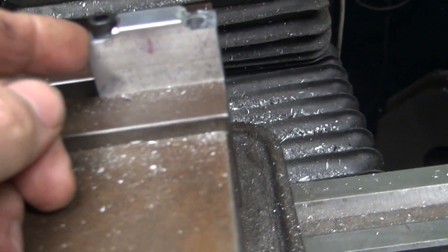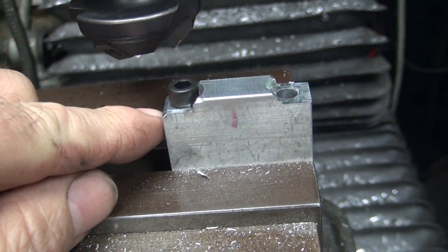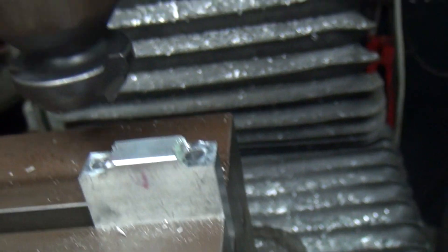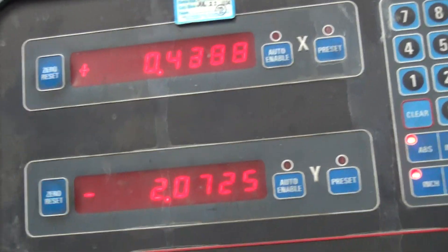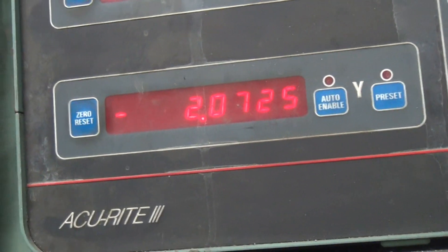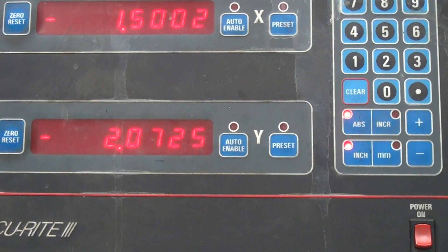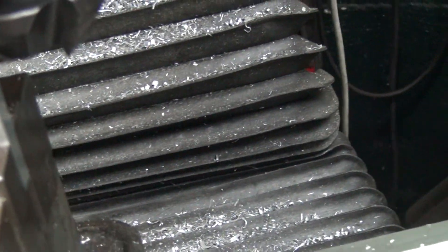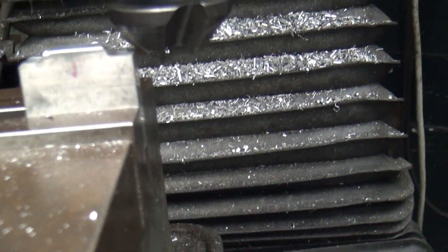Here's our bracket — cutting the chamfer. I just did this one so you can see how it looks for the bolt right there. We're going to run a little washer and hit the bolt head so it'll be about flush. I got my numbers all set up — if I go over to an inch and a half on the other side, we get the same number. So when we cut this side it should be the same number. Looks like it might be close, so I'm going to pull it back just a little bit — I always like sneaking up on things.